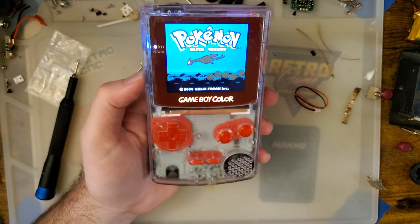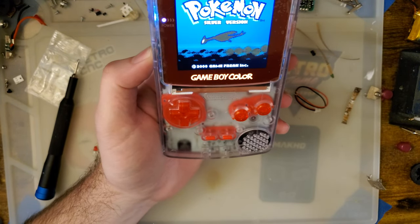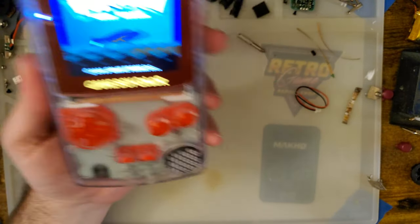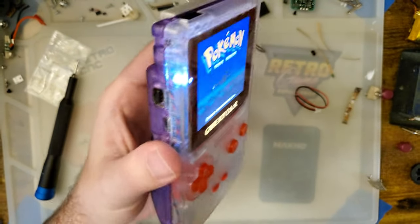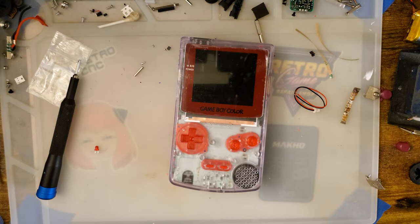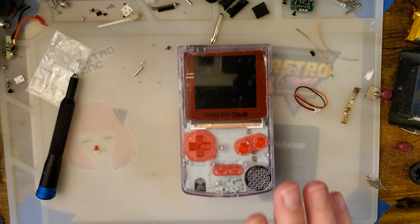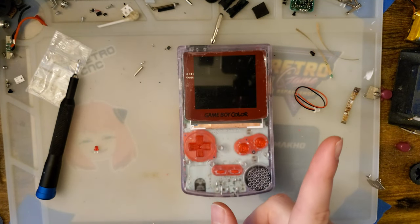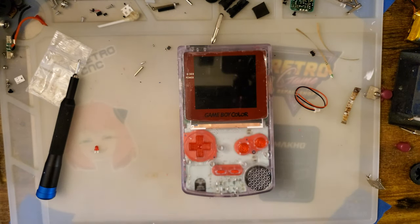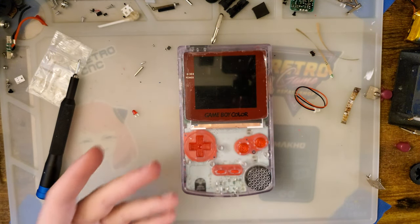So yeah, amps, the boost regulator boosts, and the battery charger charges. As far as performance goes, I have no concerns, I have no issues. The only thing, and I have not studied the schematic, so do not quote me on this, but I'm fairly certain there is no load switching. And you know what, before I have to go eat my words, let me look at the schematic. So in review of the schematic, I don't see anything in there that handles load switching.